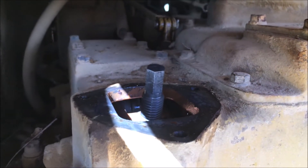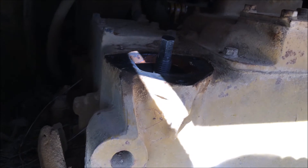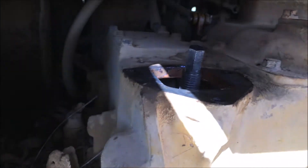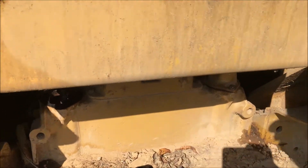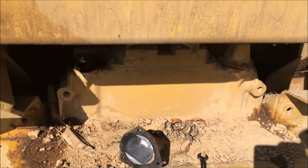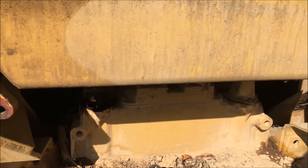You turn it in very small increments. When you adjust that bolt — when I say very small increments — what it is, is you really need to drive the machine. If you've been driving it a lot, you can feel the brakes, whether one's too tight or too loose. So very small increments on both sides until you feel exactly what it feels like from driving it. Then you'll say one's more than the other, and you'll have to stop, turn it off, adjust it, put it all back together, and drive it again.